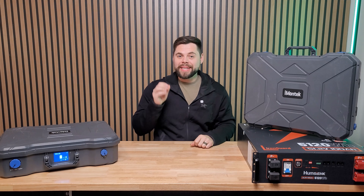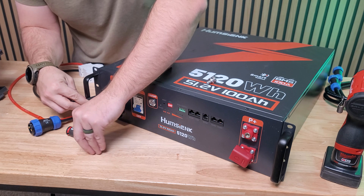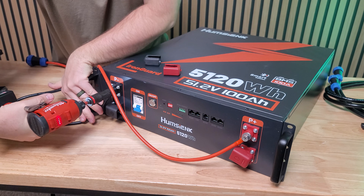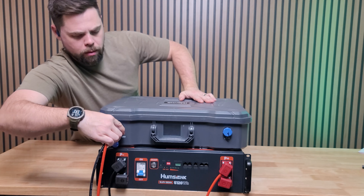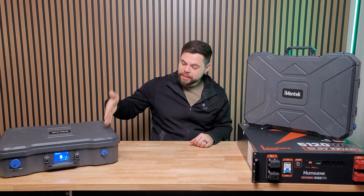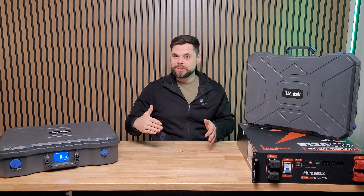What is so mind-blowing and different about the Imantech X1200 is that you can use a server rack battery. I'm going to have a separate review dedicated to these Humpsync server batteries because they're quite impressive — around $600 to $700 depending on sales. Imantech is perfectly fine with people using their own batteries because lots of people already have these. The battery cells inside the X1200 are lithium iron phosphate, rated to 2,500 cycles. Most other brands and models are rated to 3,500 to 4,000 cycles.